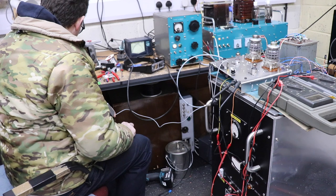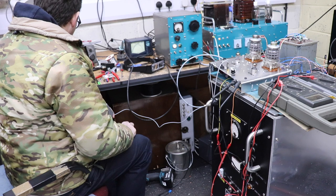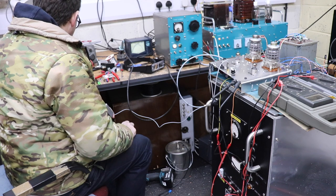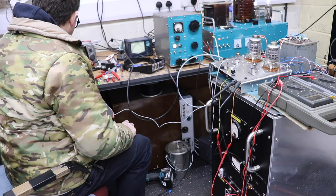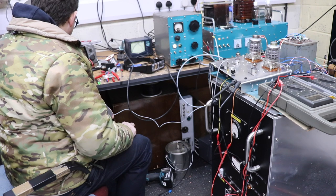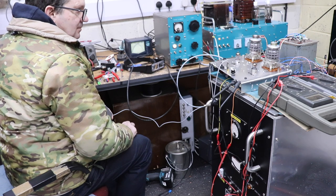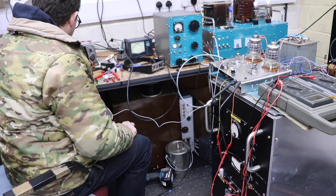G6TBJ returning. Yeah okay Justin, all copied. I've just got a little video there. I just opened up the filters on the HF 225 — I normally listen on the 4 kHz filter, and it sounds quite a lot brighter actually on 7 or 10 kHz. It's quite a bright-sounding transmitter — you've certainly got plenty of HF content there, so it's not muffled in any way. Quite different and characteristic, I think, to the Class E.